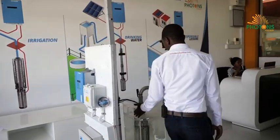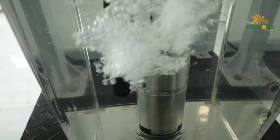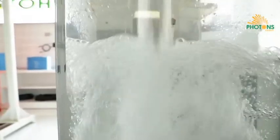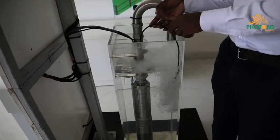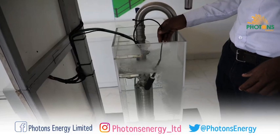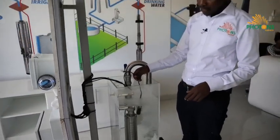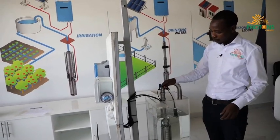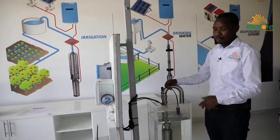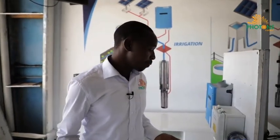This is now a live demo — our pump is working and pumping water. We've also installed some accessories for protection purposes. We have a well probe, which protects the pump from running dry, because running dry is risky and may damage the pump. If the borehole dries up, the probe will be above the water level and will switch off the pump automatically.